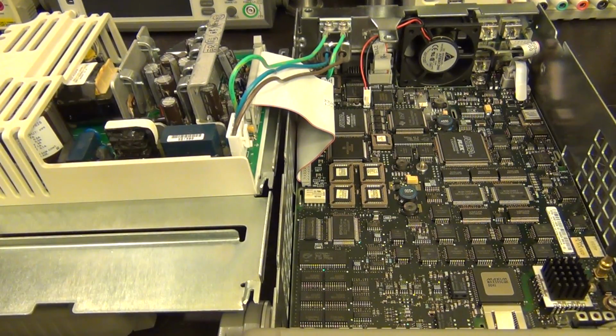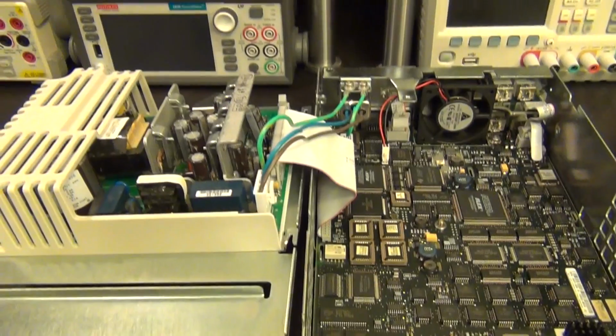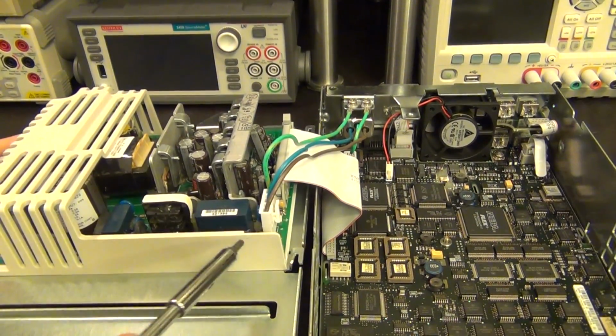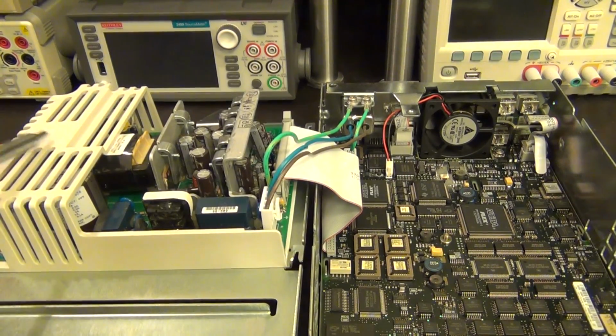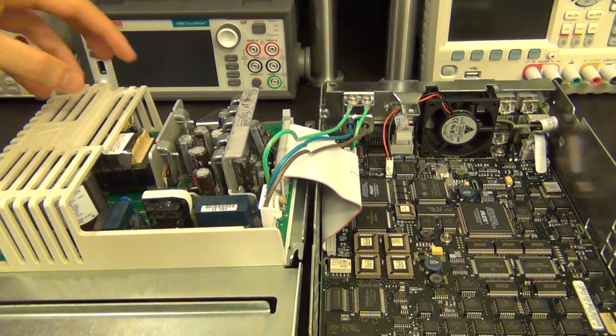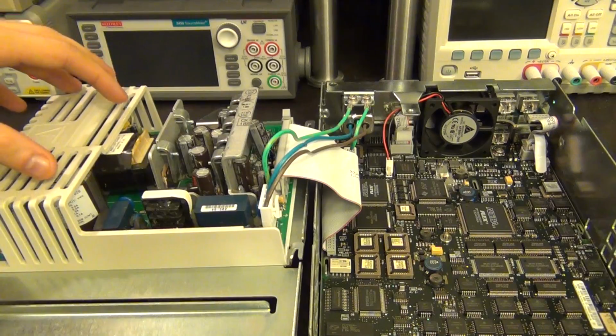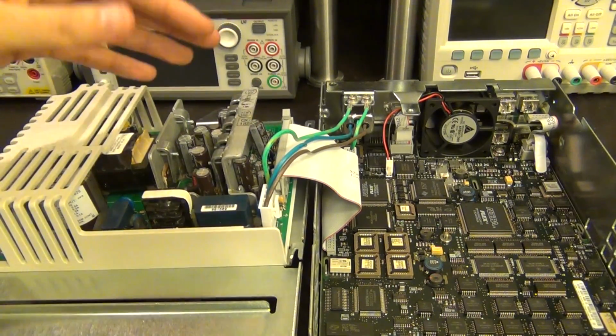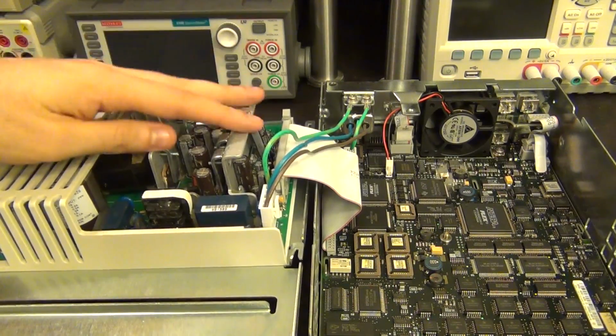And it's interesting to take a look at the power supply also, because the power supply clearly has a section that's blocked off by this plastic piece, and again there is another warning symbol on top of it. So whatever is underneath this portion is sitting at a high voltage, whereas these heat sinks probably are not. And it's not plugged in, by the way, right now. So, you know, probably touching these wouldn't matter.